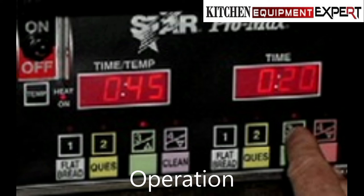Operation. 1. Press any program button (1 to 4) on either side to begin the timer countdown for that side. The LED for the appropriate program will be lit during the countdown and the remaining time will be displayed. The countdown may be stopped at any time by pressing the same program button. The display will return to the program time of that button. 2. When the display reaches 00:00, the buzzer will sound and the digits will flash. 3. Press the program button to silence the buzzer and return the readout to program time. 4. The right and left boards will operate independently of each other. Both timers can be in operation at the same time; the display will show which side is timed out.